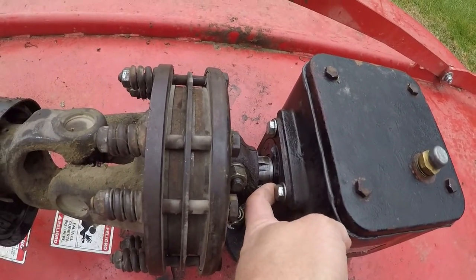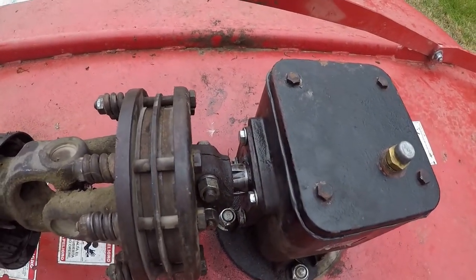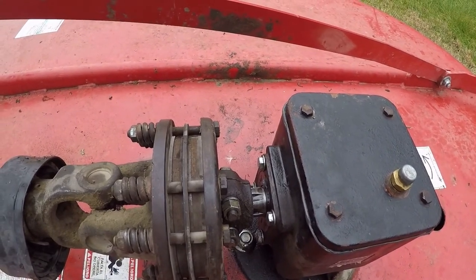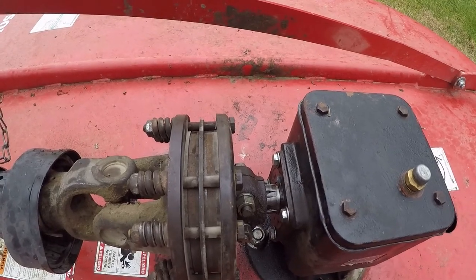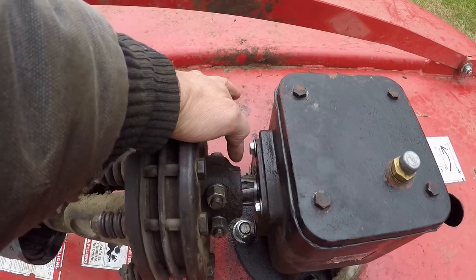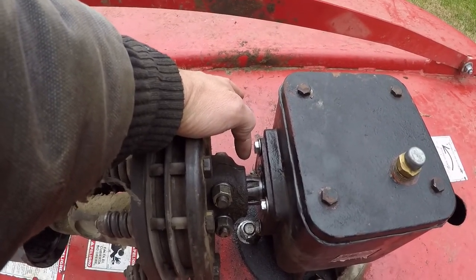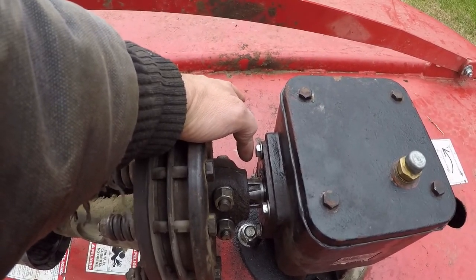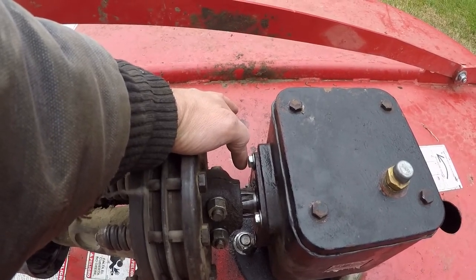and then a snap ring that pops into a groove, and then some shims, and those shims are kind of what were causing the problems, we think. Maybe some wear in the bearings. When we were running it last week, it had sort of pushed the side of the seal out but hadn't popped out completely. And I think it had done the same thing as it was doing this summer, where it popped that snap ring out of the groove but had wedged the bearing race sideways so it didn't continue to push out. So we kind of ran it crooked and figured that was probably not good on things.